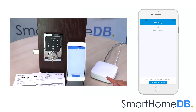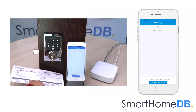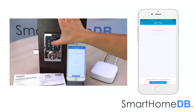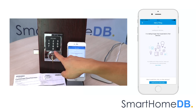The Samsung SmartThings Hub's LED will blink green indicating that it is in pairing mode. We proceed by pressing on the Schlage button of our Schlage Z-Wave lock, followed by our unique programming code which we can find on the sticker of our instruction manual. We finish by tapping on 0.